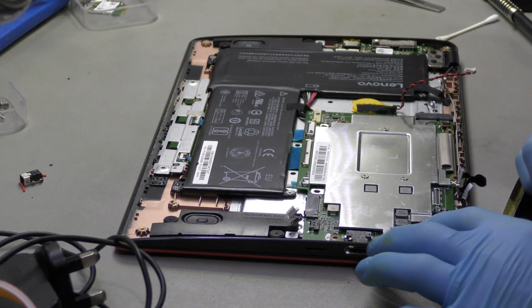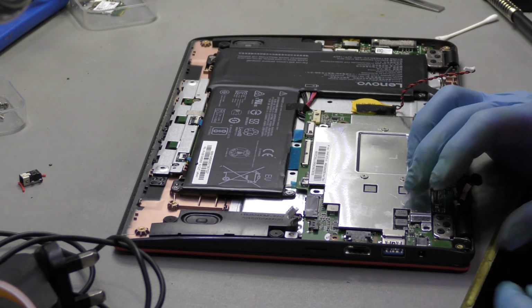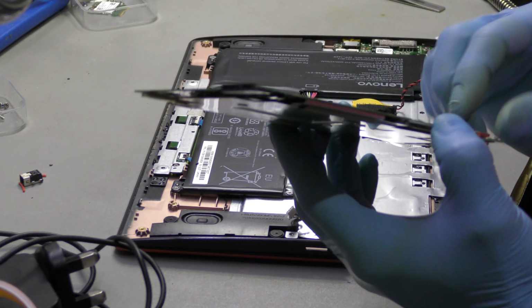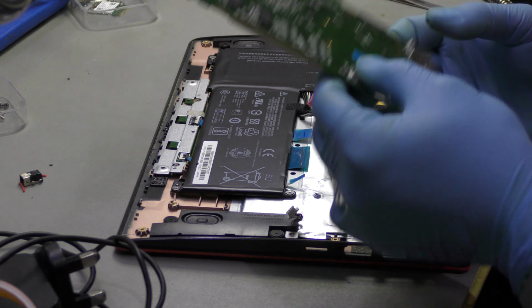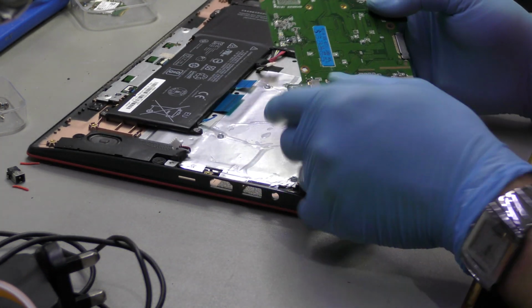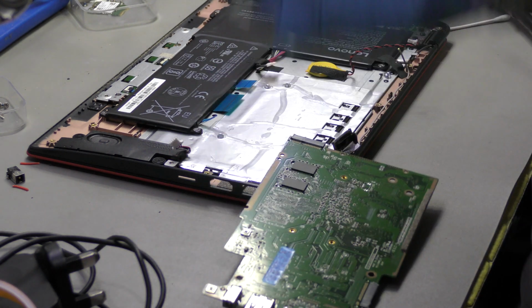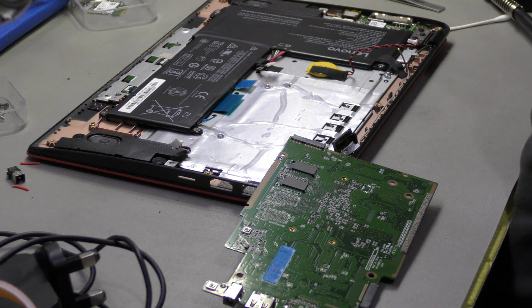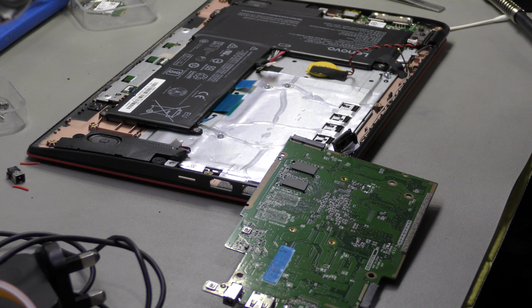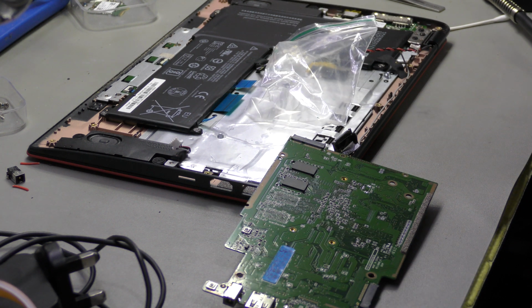So look, it's lined up perfectly, there's no issues at all. So where did I go wrong before? I don't know. Right, what I'm going to do, guys, is I'm a little bit wary about this exposed contact here, because there's some metal keyboard contact. So I'm going to apply a bit of solder mask on that jack. Now unfortunately, by doing so, this will become a long-winded repair, which neither I nor you guys were expecting it to be.